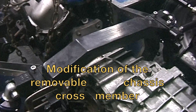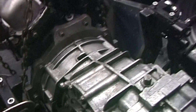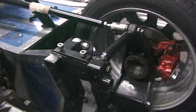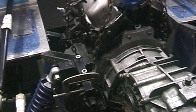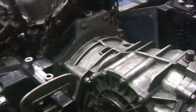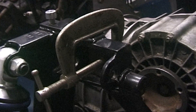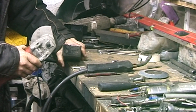I think I've got a slight problem here - this is the cross member which bolts in so you can take the engine out. I take it out of position and that's bolted in through these holes here. Unfortunately you can't get at them without taking the suspension off, so it means you've got to unship the rear suspension and take the engine out. So what I'm going to do is see if I can weld the plate inside that's held in by the clamps and tap it, thereby hold the cross member in with a couple of bolts which you can get in and out easily without taking the suspension off.